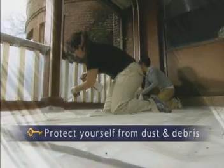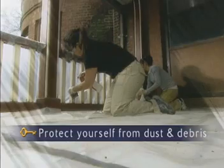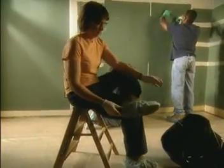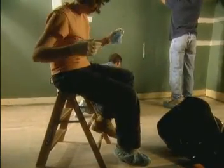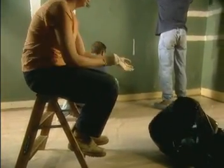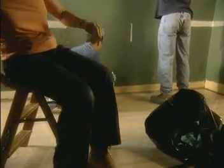Also, make sure to protect yourself from lead poisoning by keeping dust down and working lead safe. Once the work is begun, avoid tracking lead dust out of the work area. Always wipe your shoes or take off paper booties before you leave the work area or step off the plastic sheeting.